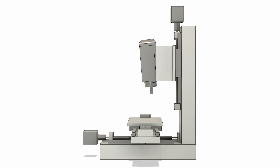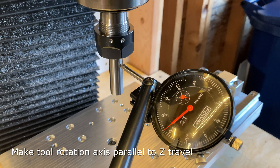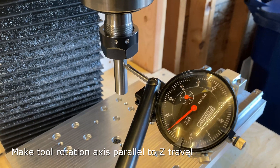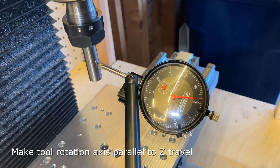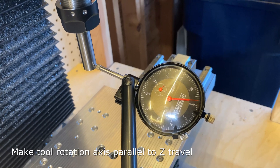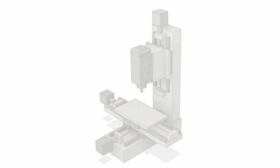For adjustment in the other direction — the nod of the head — I did the same setup, just moving the dial indicator to the front of the gauge pin. This wasn't out very far, only maybe 1 thousandth per inch at most. I found most of the error was just due to the mount not being perfectly snugged up against the head. All I needed to do was loosen the bolts, clamp the mount tightly to the head, and clamp the bolts back down — that took out the last bit of error. Now I have a square mill and will be able to more accurately mill things that have perpendicularity to them.